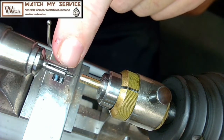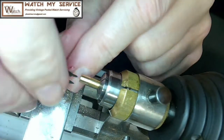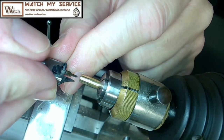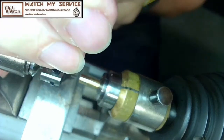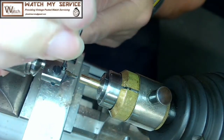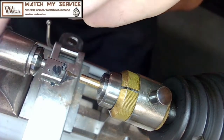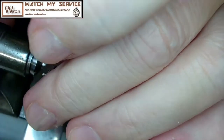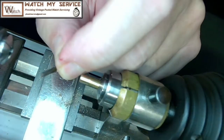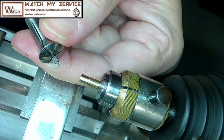I think the best approach is to remove this blade first, measure where I want the second blade to be, and set that blade so it's nice and tight. Then remove the other blade altogether, collet that up in a different collet, and just use that width. So I take out the whole configuration, remove the first blade, and put the second blade directly in a collet to see if it's centered when spinning.